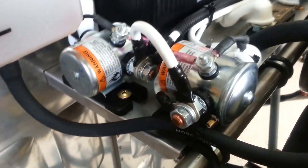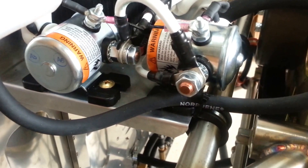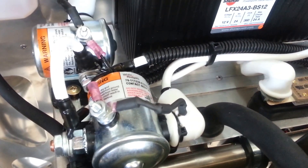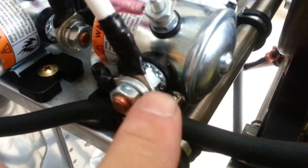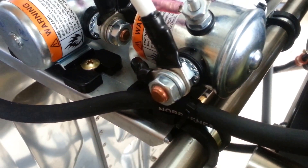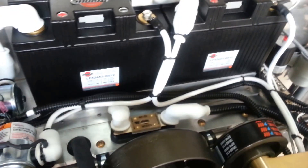You can also follow this in detail on the wiring diagrams. What is important, more so with this physical video, is that you understand the seriousness of what you're doing. You do want to make a very organized, very nicely laid out arrangement of the wiring. You don't want to make any inferior crimps. You don't want to solder anything. You want to have the proper tooling to make the crimps on the lugs. You want to get the type of battery terminal lugs that are heavy duty. Use lock washers and the proper torque on all the fasteners — just very basic aircraft quality workmanship.